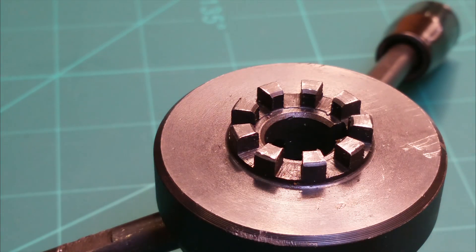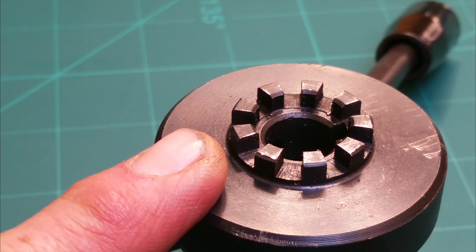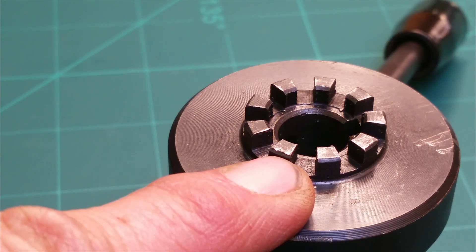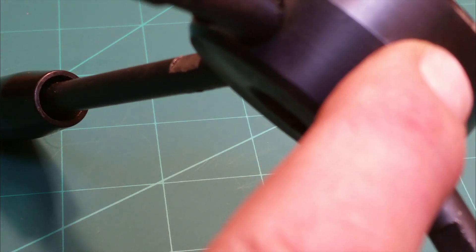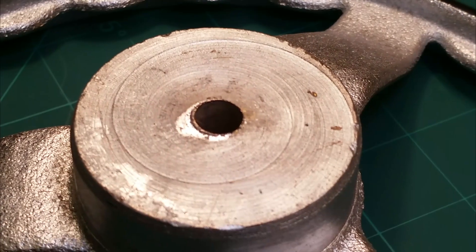However, what I'm going to bet on is that if I ever need to come back to something like this, it will be in a future where my skills have improved to the point that I will know how to cut this kind of pie crust gearing — put it on the lathe, lathe it down to about there so we've just got this top cap bit, and then bolt it straight on to the top of that hand wheel.